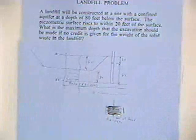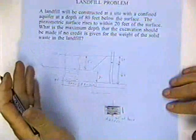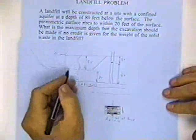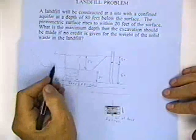What would happen if I dug deeper than that, if my measurements were true? The water pressure pushing up would exceed the pressure pushing down, and the bottom would come up and the hole would fill with water. If I had a scraper and a scraper operator down there, he'd have to unfasten his seatbelt and swim for his life. You could visualize standing there at the end of the day. This guy did this. Your scraper's down there. You've got to explain to the battalion commander why your scraper's under 50 feet or 30 feet of water. And you're standing there saying, things cannot get any worse. That scraper's down. Fortunately, the operator swam out.